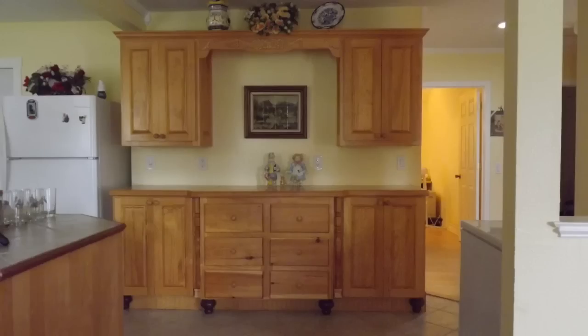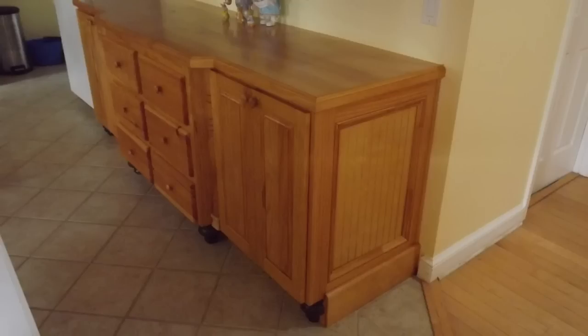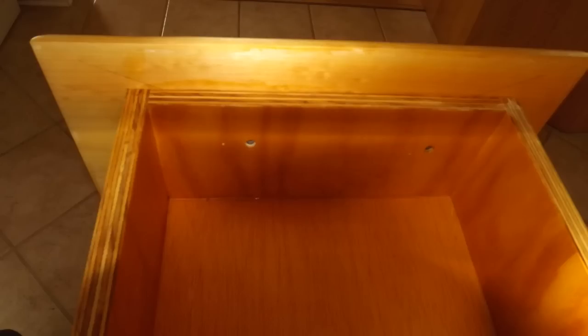This is a set of cabinets that I built with a Kreg jig. The sides of these cabinets, just like in the garage, are made with face frames that we just put paneling and trim in. This is the apron board that connects the two upper cabinets together and has the applique attached to it — you can see how I used pocket holes to connect the board to the upper cabinets. This is the underneath view of the upper cabinets showing how I used pocket holes to create this cabinet, and that's the under-cabinet lighting. Just as I had shown in the garage, I made the drawers with pocket screws. You can see that the face of the drawer hides those screws, and from the back side — from inside the drawer — you can't tell it was made with pocket hole screws. And it's a very, very strong joint.